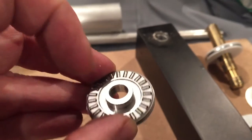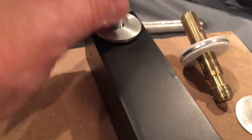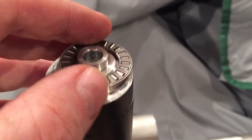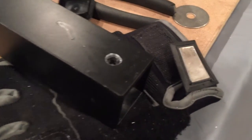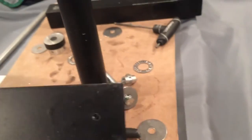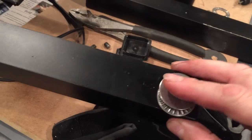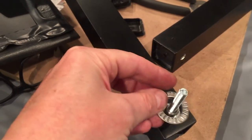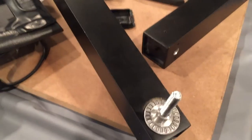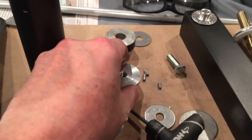So we replaced that with straight bolts going through the arms. Instead of complicated shims and washers, we simply used thrust bearings to separate the two arms, top and bottom of the bolt, then crank it down nice and snug so there's no more sag. If you're building this new, you don't need the old approach at all — just drill straight through the tubes. You might want to put a tube inside the square tube so you don't crush it when clamping down on the bolts.